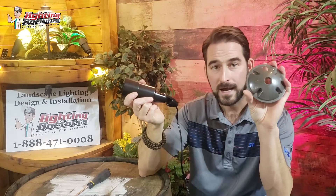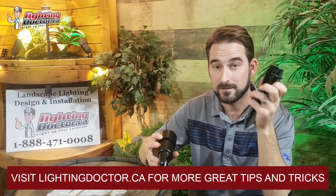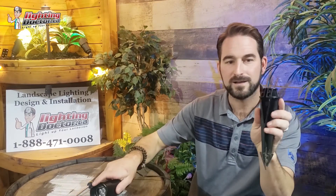Same as most uplights, it has a half-inch male thread at the bottom, so if you're looking to mount it somewhere else, you can go to the electrical aisle at any home improvement store, get any mounting bracket with a half-inch female thread, and you're set to go. The other thing I really like is the ground stake from FX Luminaire. It's a very durable six-to-eight-inch ABS stake with a little slot. When installing, you can hammer the stake in the ground first, then slide the fixture in and screw it down — whereas with a lot of other stakes, you have to thread the wire through first, and when you hammer it down you can pinch the wire and the light won't work.